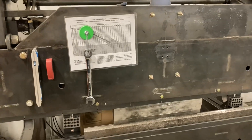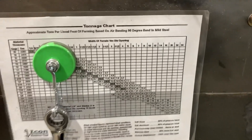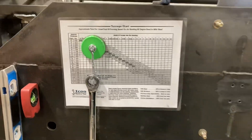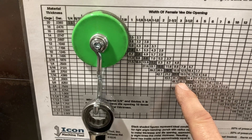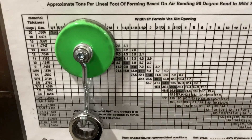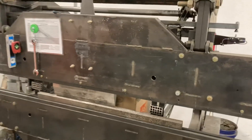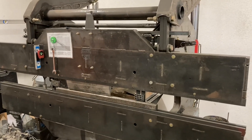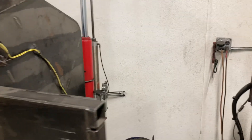I keep that chart handy — it's a quick reminder to know what size die I should be using if I've got to do something weird and make a die, or borrow something from a friend. With this chart, in the past I've found bending some pretty big parts is kind of the limit to the machine. By the thickness and whatever, it basically told me how many tons the machine was putting out. That's where I come to the number — this thing is about a 40 ton machine. It could probably do a little more, but at 40 tons it was really grunting. With the math, the power of the jacks and the mechanical advantage should be 64 tons, but obviously these Chinese-made jacks were a little optimistic in their rating.